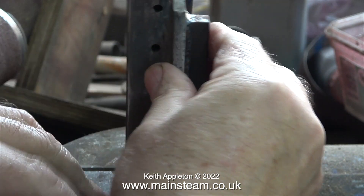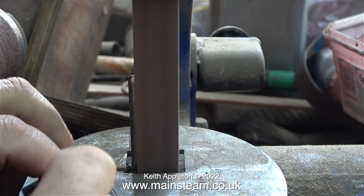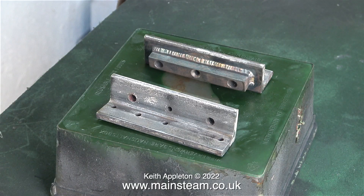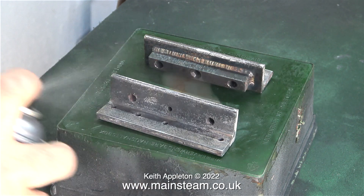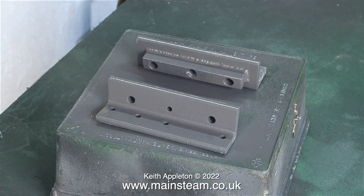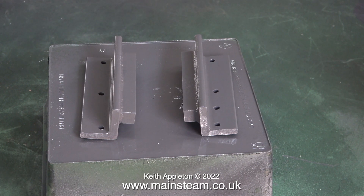Here I am in the outer part of the workshop doing just that. I place the parts on the bench ready to paint, and the noise you can hear is me shaking the can of paint. It's a rattle can filled with etching primer and here I'm painting the parts using it. This etching primer really does go on well — once it sprays it spreads out very evenly, and because the paint contains an acid that eats into the metal, it really does stick well.